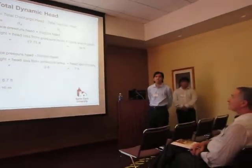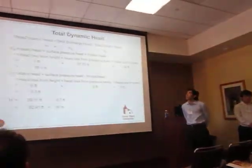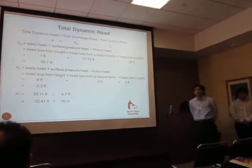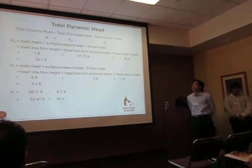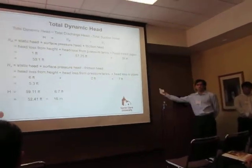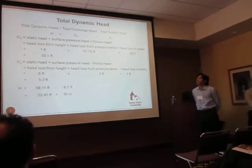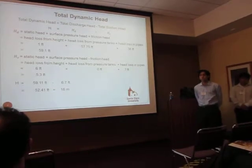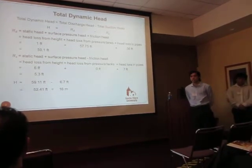Okay, as you said, the first part I'll be talking about is the pump. When selecting our pump, we wanted to note the losses that we would have to overcome in our system. So that's what this calculation is here, the total dynamic head, which is basically the difference between the discharge head and the suction head.